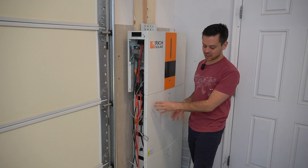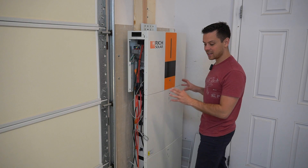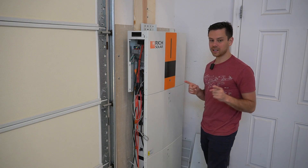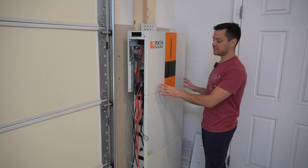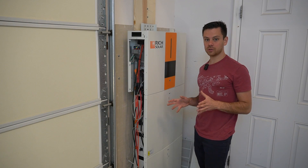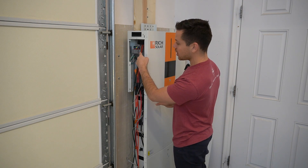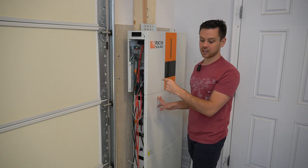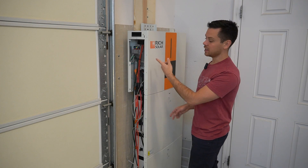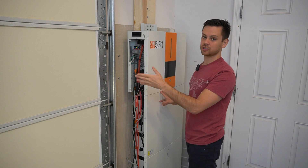Once it was set up, everything stacked on top in minutes. It does have a few downsides: scalability is a pain, you have to buy their batteries, multiple-battery configuration is a pain, and split-phase output is also a pain. As a standalone unit with one inverter and two batteries, this is perfect for a cabin. But if you want an expandable system with other manufacturers' batteries in the future, this is not for you. Also, do not use combiner boxes — you have to use ungrounded solar arrays only, just like all other all-in-one systems, because you can shock yourself at the MPPT terminals.